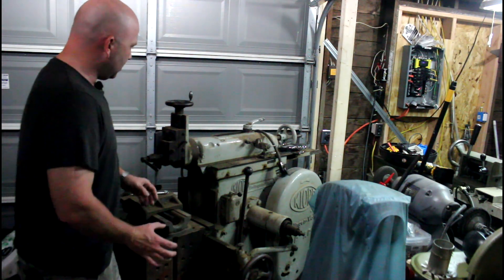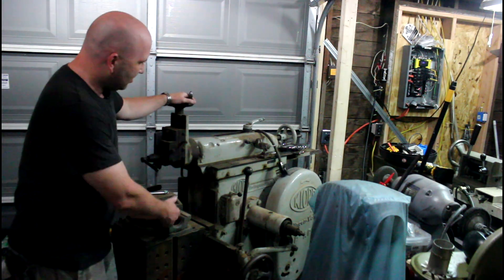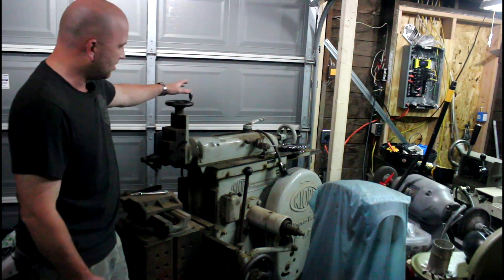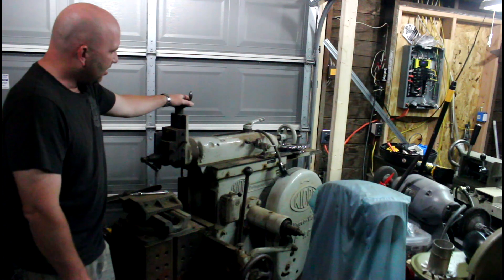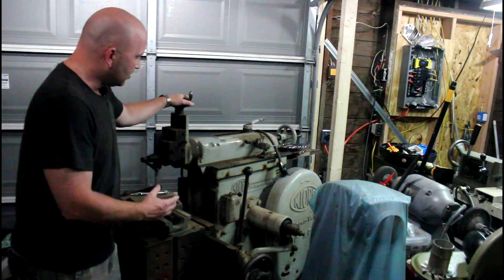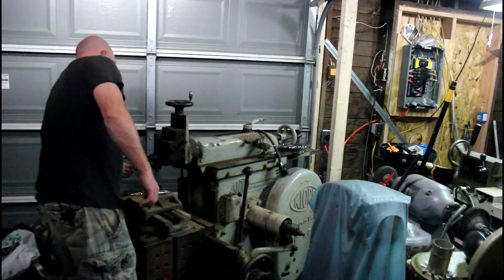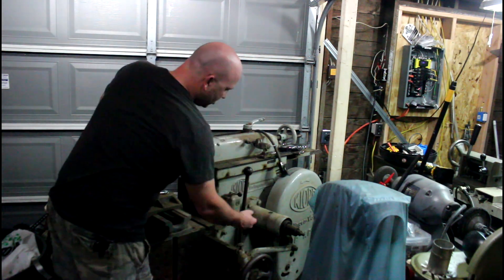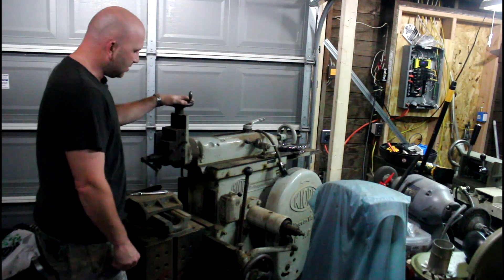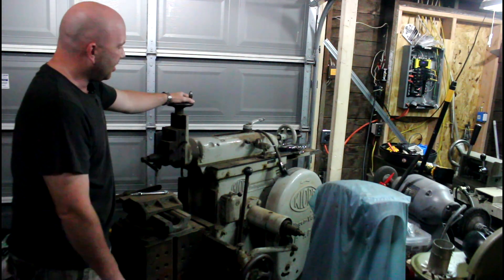It is in relatively good shape because of the coatings on it. It appears to use grease zerks, so it runs with grease, which is kind of odd. I'll have to double-check — if I can find a manual for this guy I want to make sure those are correct and shouldn't be oil. Most of the other machines have oil cups on the shafts, but these are all grease zerks, so maybe it just is a greased machine.